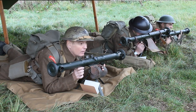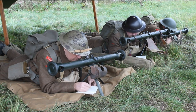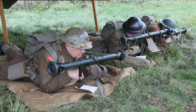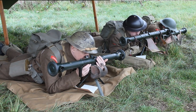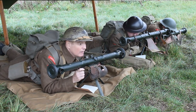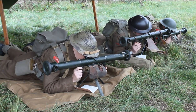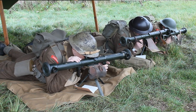Start a new column as well, so new object, weather conditions the same, date the same, still zero for your adjustment, coincidence adjustment set in, but just do a few on that new object just to get your eye in. Now, remember our focusing lesson? You're going to look at it, rest your eyes on it, and then come back to the instrument.